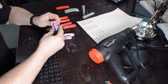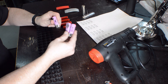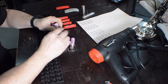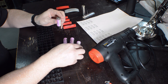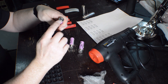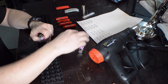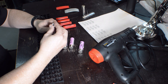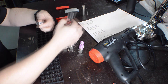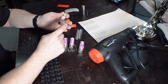I just want to give some examples of cells that are kind of gunky. Here are some Samsung cells that came out of laptop batteries - they were really gummy with all sorts of glue and gunk on them. They don't come clean; you can scrape at it but it takes forever. This one here is a safety issue because the skin is exposed. The positive end of the cell, with the negative going all the way up the cell, needs to be properly coated. It's also important to have good gaskets on the top to give separation between positive and negative. When you place a skin on - here's a clear one and here's a red skin - it covers that end so you have good coverage.